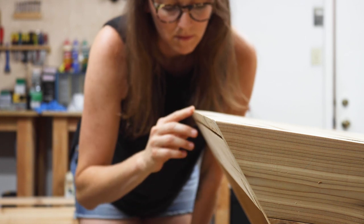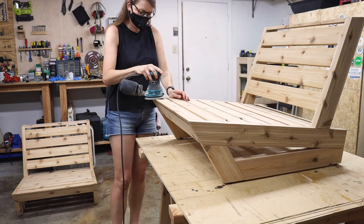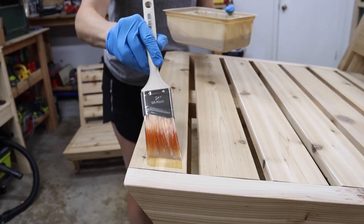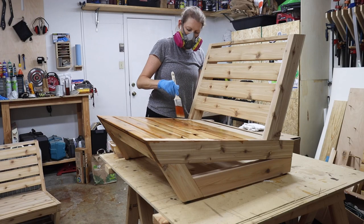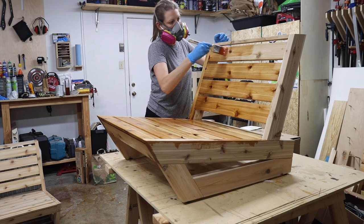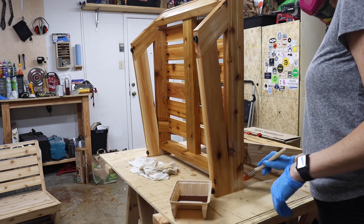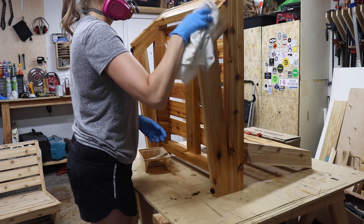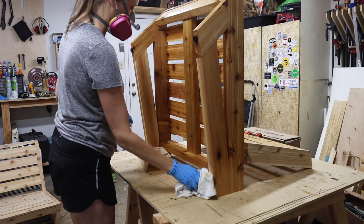The last thing I did before finish was to take a sander and slightly round over the sharp edge on the front of the chair. For a finish suitable for exterior use, I'm going to use a mixture of teak oil and spar urethane — I learned about this mixture from Izzy Swan's channel. You mix 70% teak oil and 30% urethane, brush it on, leave it for about 5 minutes, and then wipe it off. My chairs are going to be under a porch and not directly exposed to the elements; however, if you have outdoor furniture exposed to sun and rain, you might want to go with an even tougher finish.